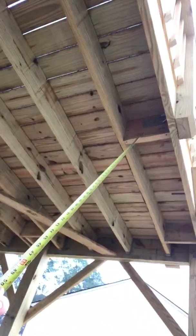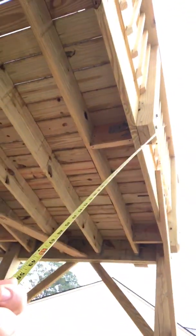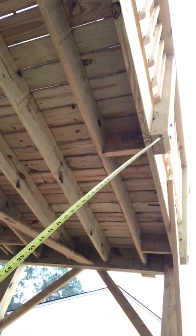So these blocks right here are really important to add for your guardrails on decks — they really help add the strength of that guardrail. Guardrail strength minimum: residential is 200 pounds, commercial is 250. So that's a great example of blocking and angle bracing.